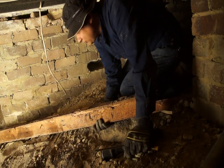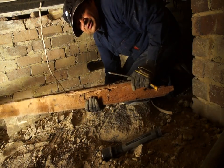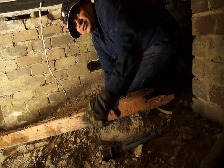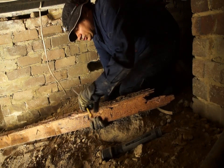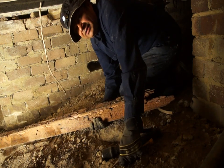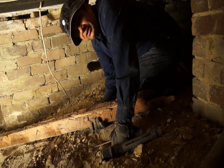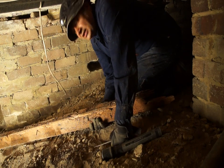It's important to remove all the loose timber from the subfloor. Because if termites come around the subfloor, first they go to this loose timber, and then they have a better chance to get into your home's timber and eat it.